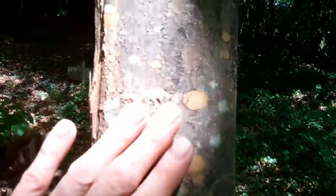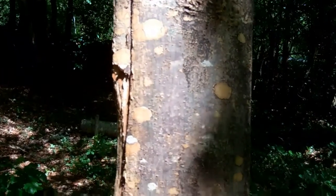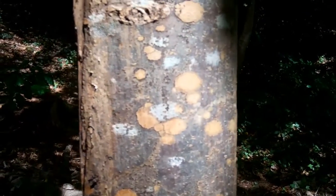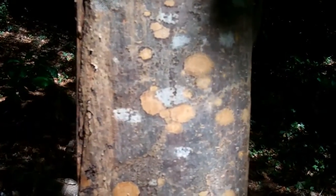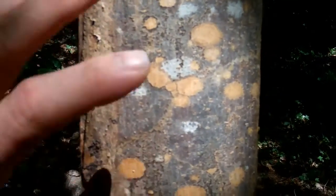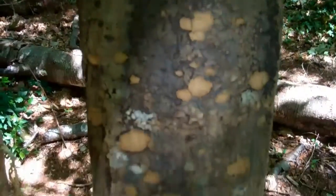Choose a piece of wood that's as straight as possible. This one's about six foot three, very straight. Have a look at the bark — if you see that the bark twists or spirals round the piece of wood, that's often the tree's reaction to being in a windy place; it spirals to produce strength. Unfortunately that's often mirrored in the grain of the wood as well. So twisty bark usually means twisty wood. What we're looking for is good straight wood, so make sure the bark is untwisted or unspiralled.